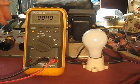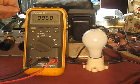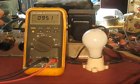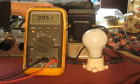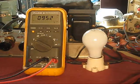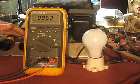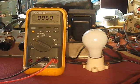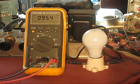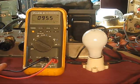And when you're doing this, there's no load on this essentially. In some amplifiers, some radios and things, there would be a load, and even if you pull all the tubes, there's still a load on it, assuming there's a rectifier plugged in. In fact, here there probably is one too, but it's very, very small. You won't really notice any significant current draw until the tubes are plugged into this, and you get some plate current going.